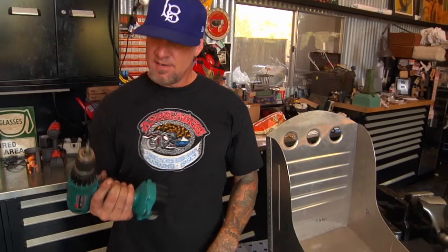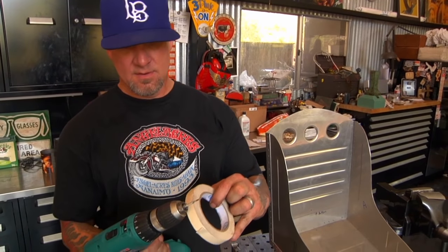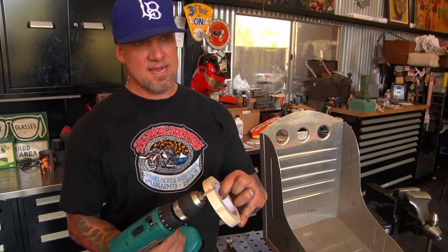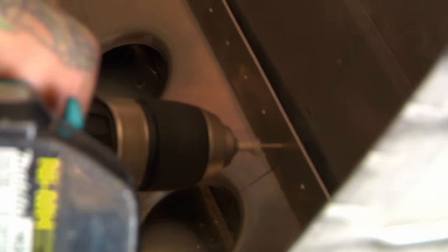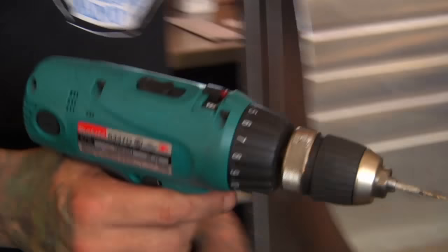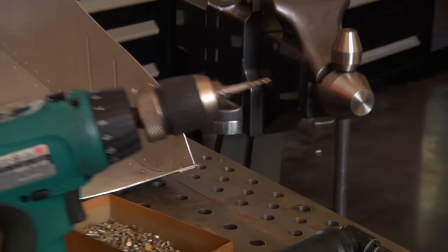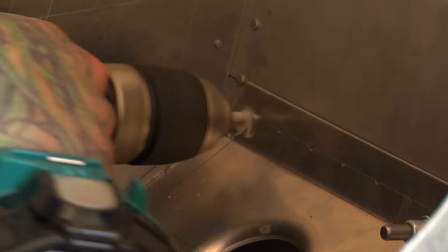I put a little piece of tape on it, just the width of some three-quarter inch masking tape, and wrap it so it's pretty thick on there. So when I'm drilling the hole, it hits the tape and stops and doesn't run the chuck into the piece. Because if you're riveting something polished, that's just gonna put a big donut, a big scratch right where you were getting ready to rivet, so then you'll have to stop and repolish it.